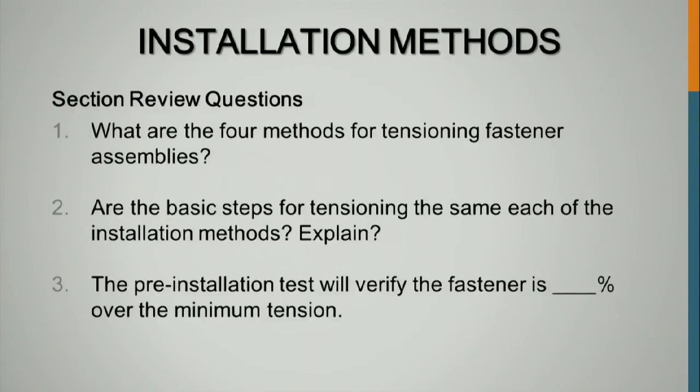All right, does anybody have any questions with the DTI? What were some of the questions raised yesterday by the specification guy that was in charge of that? Was there anything else about DTIs being nil gapped? Yeah, there's a lot of discussion on nil gap. I think they're going to change some of the wording in the Minnesota DOT specification to clarify the DTI nil gap, because that was a large issue yesterday.